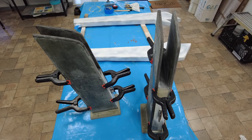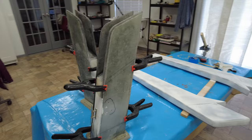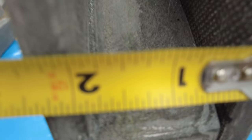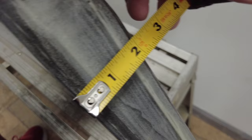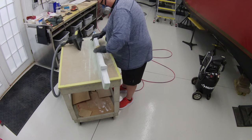With the hardware installed, it's time to start the finishing process for the base and the arms. But during dry fitting I realize there's a problem: the width of the space between the top of the base is about two inches on one and one-and-fifteen-sixteenths inches on the other. Meanwhile, the width of the arm that goes inside that slot is two inches and one-eighth on one and two inches and one-quarter on the other. Basically the upper arms are too wide to fit in the slots of the dinghy davit bases.